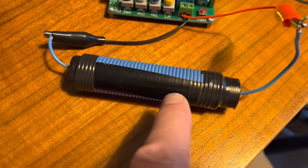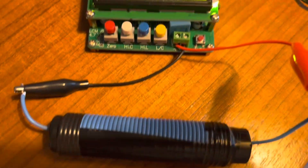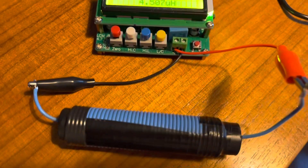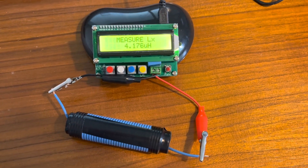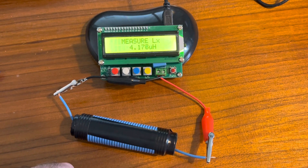When I swapped over the poles from bamboo to fiberglass, I rewound the coils — I added another four turns, taking them to 40 turns. That increased the inductance reading to 4.5 microhenries from about 4.2. I thought this would reduce the length of the outer arms, but it didn't make much difference, so I went back to 36 turns in the end.